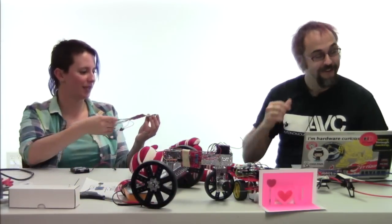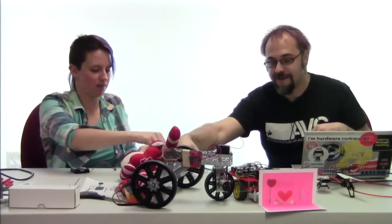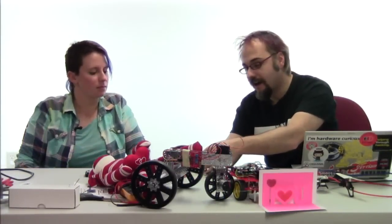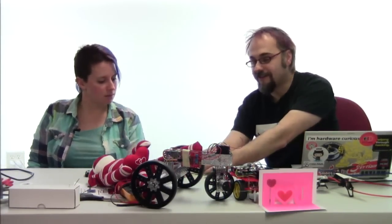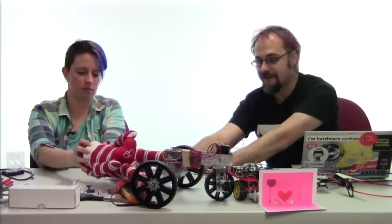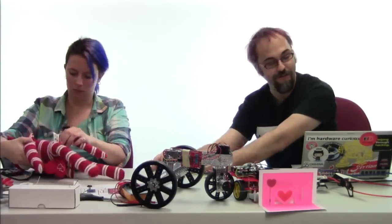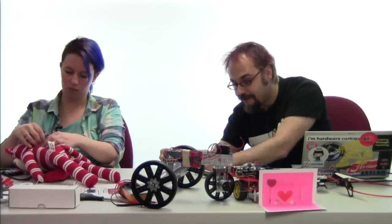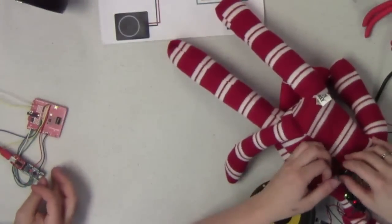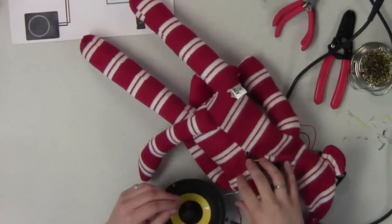All right. So Mike, I'm going to give you the circuit here to get it powered up. As I mentioned earlier, we've got an FTDI basic going here. We don't need to necessarily worry right now about having the battery pack attached to the circuit, because the circuit is small enough that we can power it over the FTDI basic connection through the USB port. So I'm going to go ahead and plug that on and make very sure that I am not plugging it in backwards. And I hear a little bit of talking there.